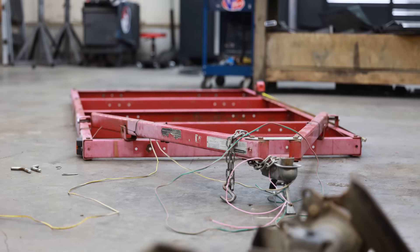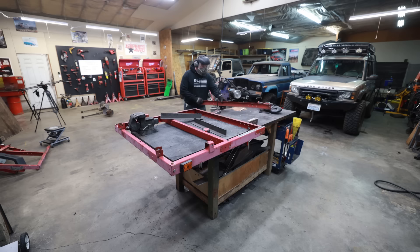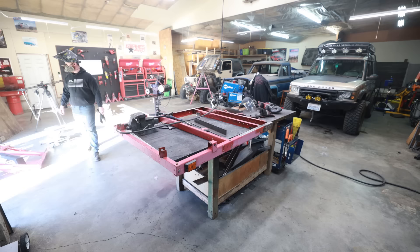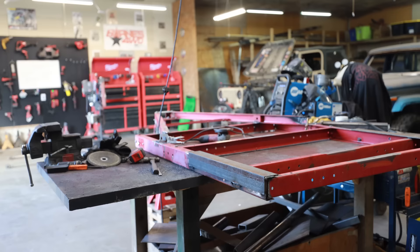The original design of this trailer is actually kind of cool — you can fold it in half and put it in a shed or the side of your shop so it doesn't take up a whole lot of space. But this has big pros and cons. The pro is portability, but the con is strength and long-term reliability. I already removed the center hinge, and now we're going to try to weld everything up as one solid unit.